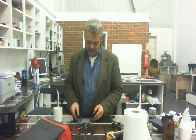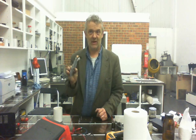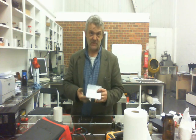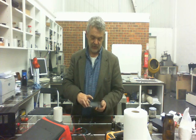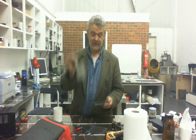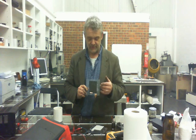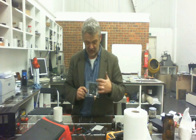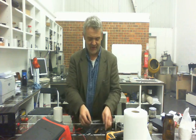In this video we're going to go through a whole series of processes showing you really how to make an experiment with this. This is the Baker 6 solar cell and it's made out of two bits of plastic. Underneath those two bits of plastic is a bit of aluminum mesh to act as one electrode and a strip of copper painted on the other. This is the finalized version that's been painted with my ink and then has an electrolyte dropped onto the top of the ink, and that has quite good performance as you'll see later.